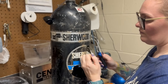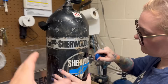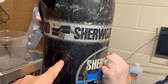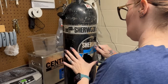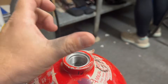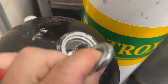The reason we do this goes way back - even before my time in the industry. When cylinders were condemned because they did not pass visual inspection, people would literally drill holes or shoot holes through the cylinders so they wouldn't hold pressure. That was how they were condemned. Unfortunately, that is not the legal way to condemn a cylinder. What we do nowadays is damage the threads so that a valve will not screw into it.